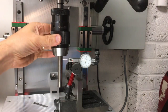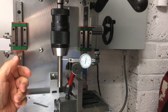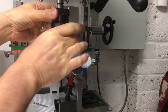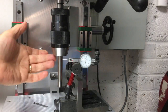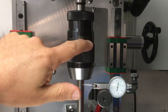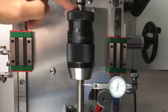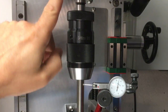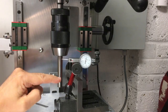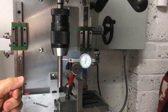Getting back to this — this is my brand new keyless chuck that I've never used. I've had it probably at least a year. You just twist the two parts to tighten bits in there, no key needed. It goes from 3 to 16mm, it's got a B16 taper, and I've mounted it on an arbor that's got B16 on one end and Morse Taper 2 into the top of the spindle. I'll be measuring runout at the bottom of this precision bar and at the top.